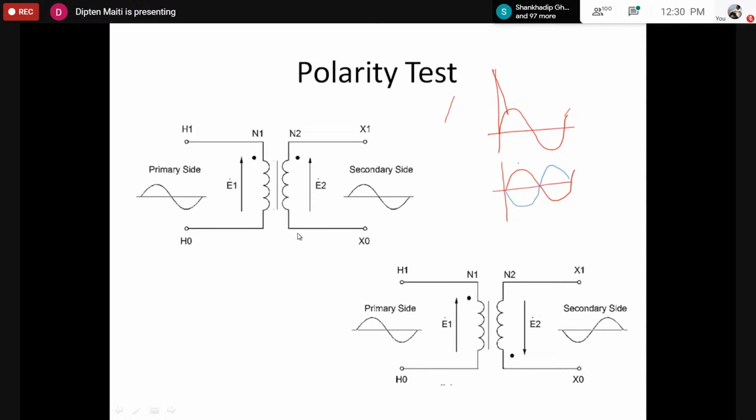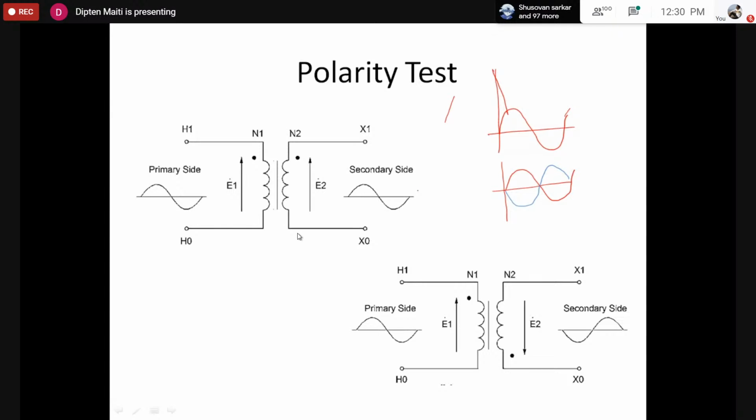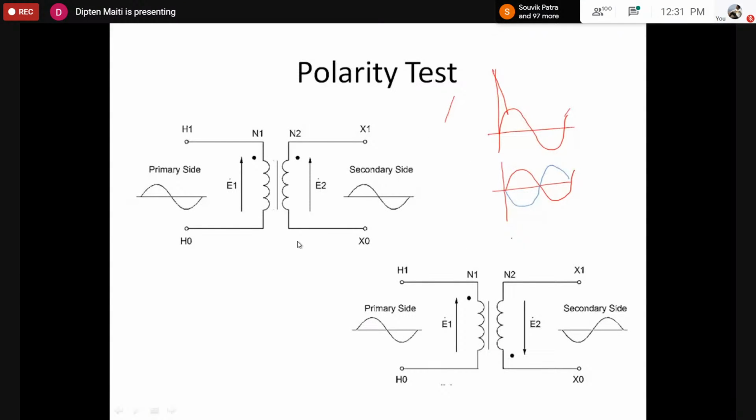Now I would take an easy path here, which you should not do. However, for understanding, that's much easier to understand. Because there are only two possibilities of phase angle difference between the two voltages, to get the other voltage we multiply by the turns ratio. You just have to multiply that by 1 or minus 1, such that we can get the voltage equation at any instant. So we would do this by considering that the two voltages are DC voltage.